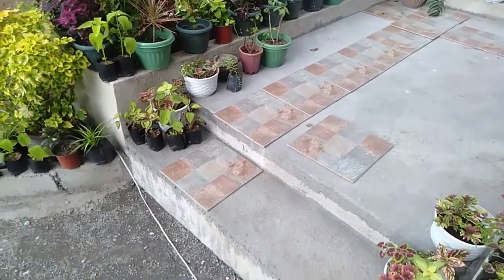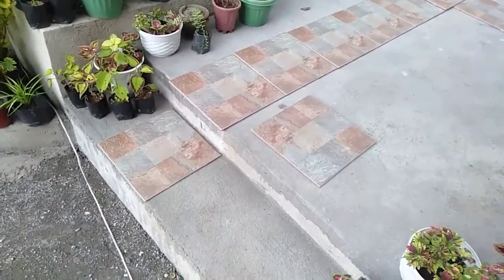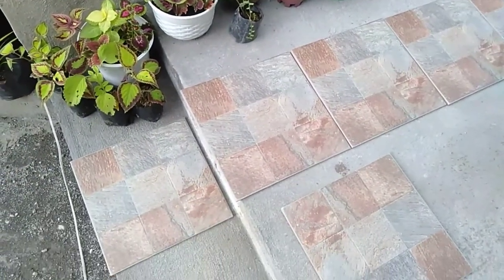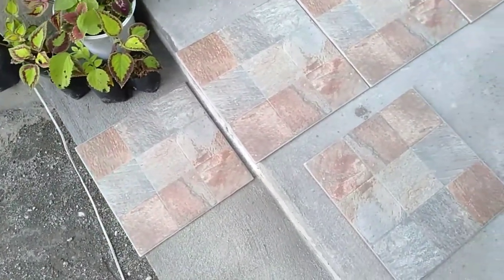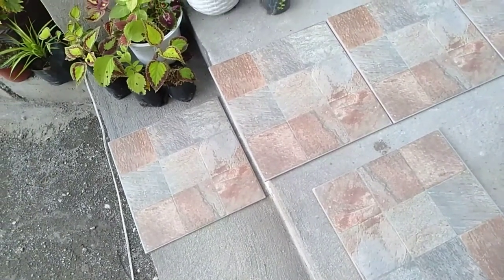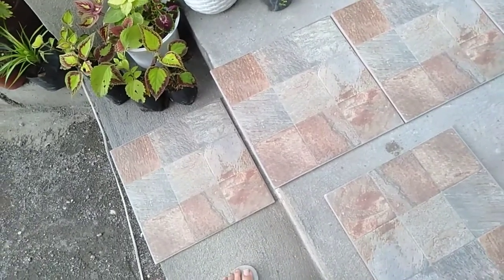There are many ways to lay out. This is the one I've always found is very easy. Just basically overhang the step by about 1/2 inch, just initially, in both steps, and it tells you roughly that you're within parameters for the riser as well, and the edge of the tile protector on the front.